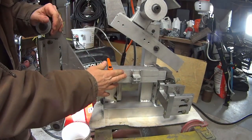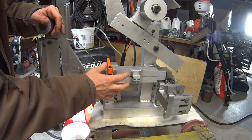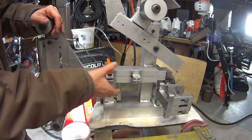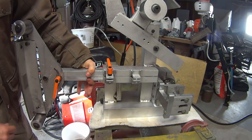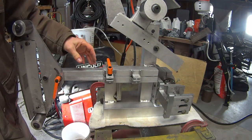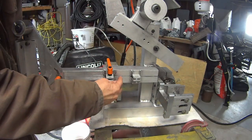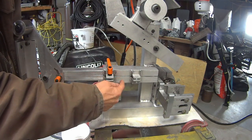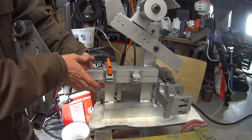This is my clamping system. It's an all-aluminum frame welded together. I've taken a two-inch square tube with a quarter-inch wall, ripped a slot in it, and welded tabs on there to form a clamp. When I tighten it, it clamps around all four sides of this inch-and-a-half square bar, centers it, locks it in place, and holds the entire length of the clamp — not just at the point of a bolt like nearly every other machine I've seen that uses set bolts.